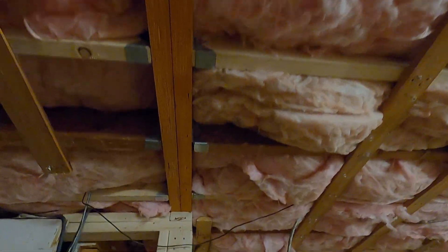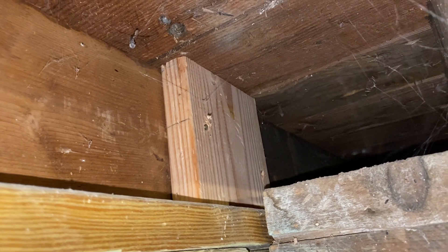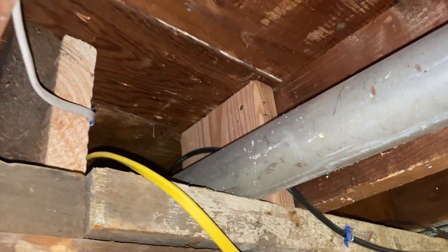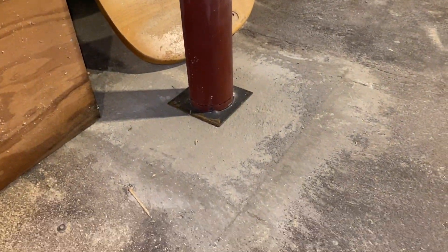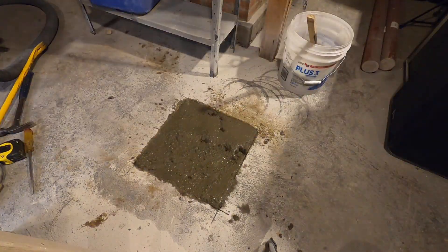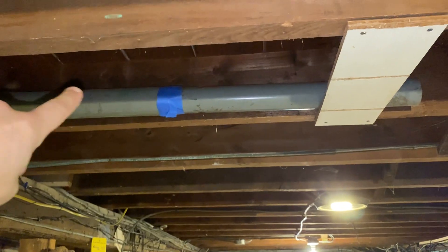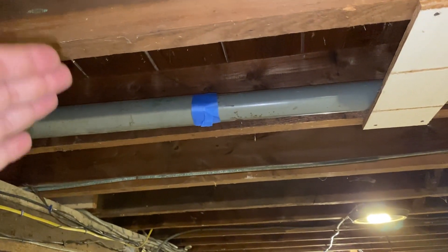So you have that beam in place and all of your mechanical fasteners or joist hangers are connected. There is one more thing: wherever your beam is supported, it needs to be supported solid to a foundation. I add a block in here and that goes right down to the foundation. Now over on the other side where the beam is supported, I also put a block in here and it comes down to this beam. But you also need to support that all the way down to something solid. What I did was I cut this concrete open and I poured a 12-inch by 12-inch pad underneath this so that all this weight is supported by this nice thick footing. That is really important, especially if you are not supporting underneath a main beam. If you ended up going in between the joists, that could definitely sag and you would have an issue. So it needs to be supported all the way down to the foundation.